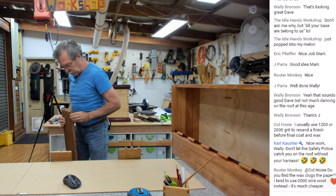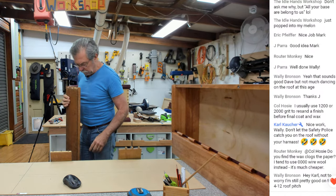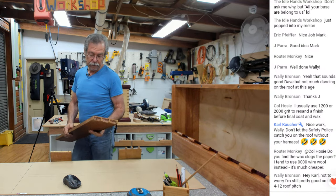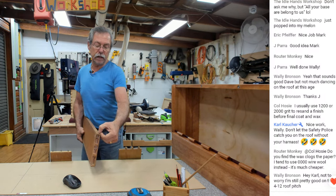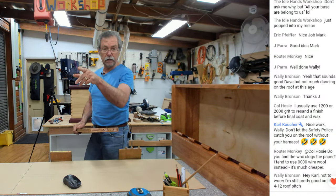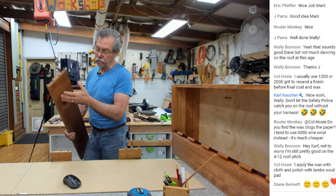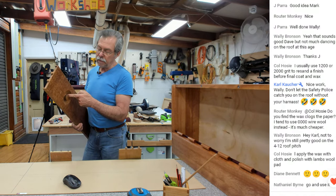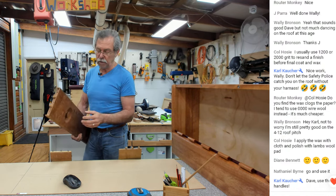But I don't know if I'm going to go with that or whether I should mill that out and put a new one in, because it's kind of deformed along the bottom there and I need it to be kind of straight. So they're my thoughts, and then I'm wondering whether I should rip this down the center on the bandsaw or just leave it at this thickness, maybe run it through the thickness planer. That may even be a better option for a lot of it. I'll measure the depth of that handle's recess and then thickness plane this down, because I don't want it that deep.